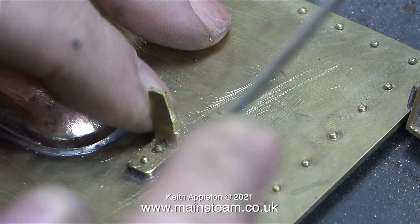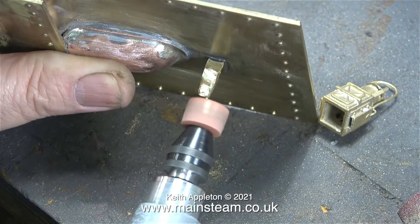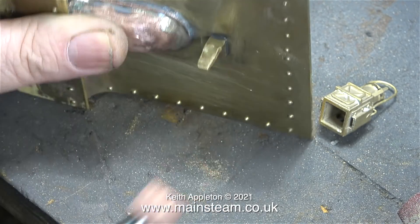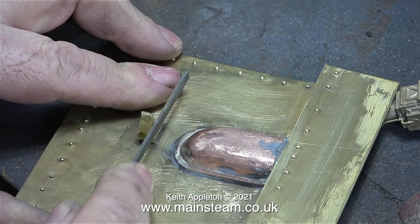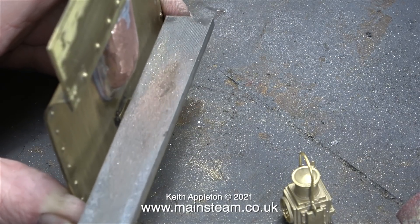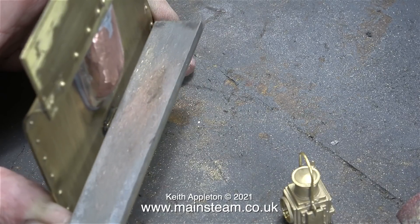I started off with a needle file, then I used a grinding wheel, which really didn't work too well and I was in danger of destroying the part. If I make it too thin the lamp will be a rattle fit, and if I make it really thin the mounting will probably break - it's only made from brass. I found it quite difficult to get the needle file to be level all the time, so I used a larger file with very fine teeth which made short work of the bracket.